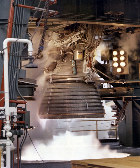The start tank assembly system was made up of an integral helium and hydrogen start tank containing the gases for starting and operating the engine. The gaseous hydrogen imparted initial spin to the turbines and pumps prior to gas generator combustion, and the helium was used in the control system to sequence the engine valves. The spherical helium tank was positioned inside the hydrogen tank to minimize engine complexity, holding 16,000 cc of helium. The larger spherical hydrogen gas tank had a capacity of 118,931 cc, and both tanks were filled from a ground source prior to launch.